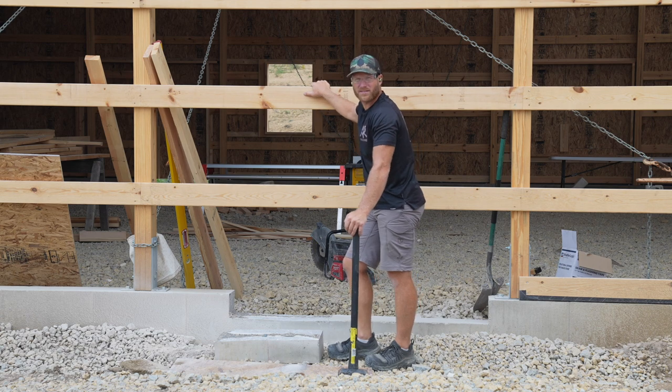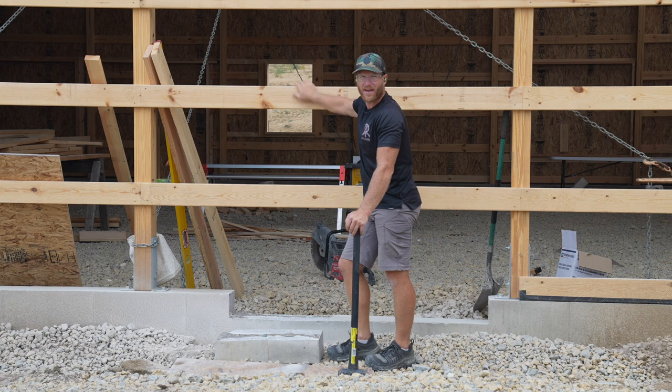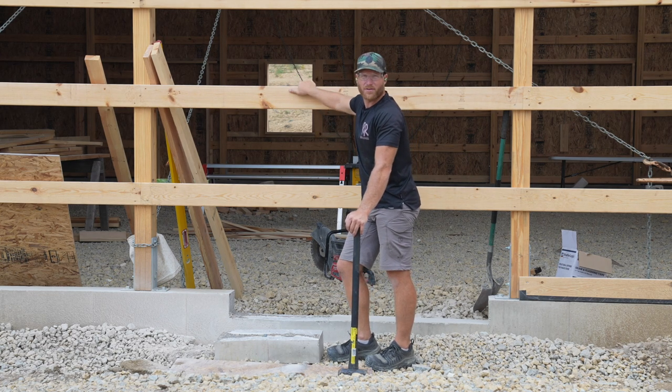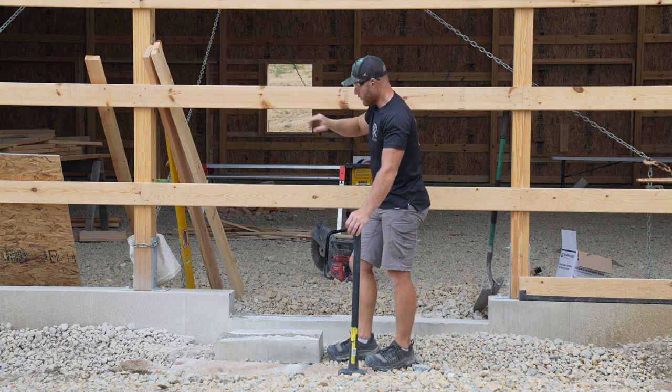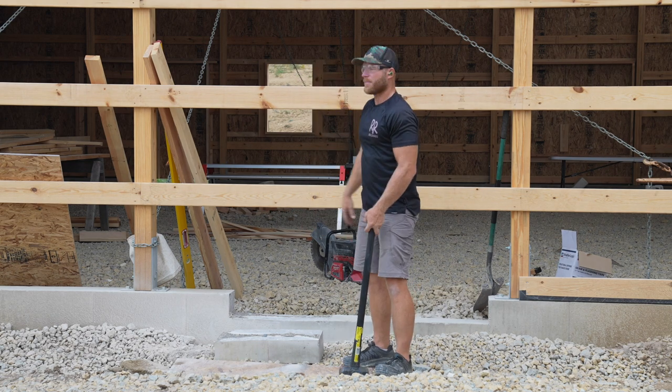There we go. So that was about 7 inches of concrete. The saw didn't have really any problem getting that out of there. That'll all get poured through with the floor when the floor gets done, and it'll go right underneath where the door threshold is so that there's a nice finish right as you walk inside this main door. So now we can go ahead and frame in this door and keep on with the sheathing.